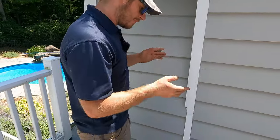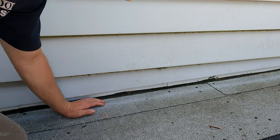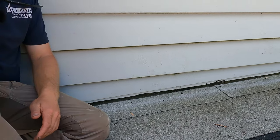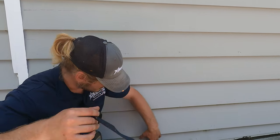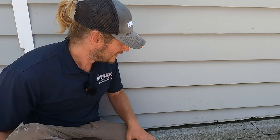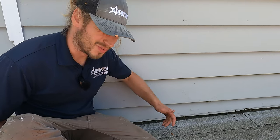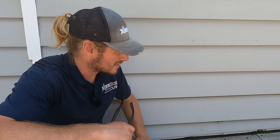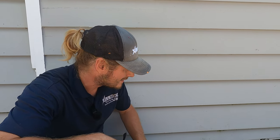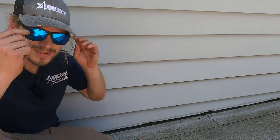We're back from lunch. Let me show you guys the actual problem here — there's a joint somewhere in this wall. See this joint right here? There's no way that joint in the tar holding it together is going to be leak-free for long. So what I'm going to do is pull the bottom piece of siding off. This is like inch and a quarter, or true one inch beveled siding — very nice, very hard to get, and very old. I'm gonna cut the nails, pull out the last bottom piece of siding, reflash this wall, and put the siding back — unless we break it.